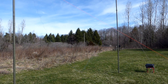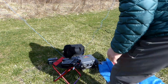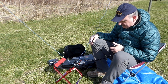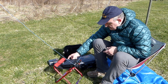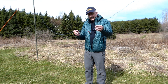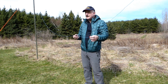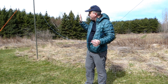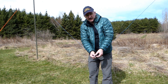Here's another look at the operating position, a little closer in. You can see that the feed point is pretty low to the ground, which is good. I've got a little stool I'm going to set the FT-817 on. My initial inclination was correct — it turns out that the antenna was too sharp an angle, so when I turned the FT-817 on, the SWR was off the scale. What I've done is taken this end of the antenna and tied it off at the 12-foot level rather than the 16-foot level and moved the pole out a little bit. This does mean I'm going to have to hold the transceiver while making some contacts, but this is all a learning experience, so I'm okay with that.